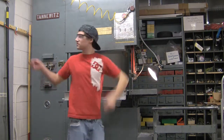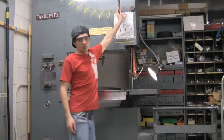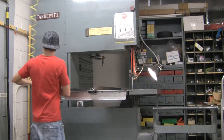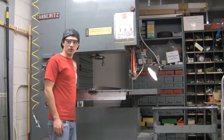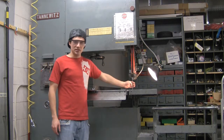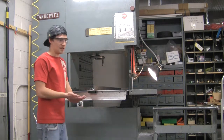There are three different blade types up on the wall. There's a dull blade, which you're going to want to use for wood, fiberglass, and any sort of abrasive material that's going to dull the blade. There is a fine blade, which you're going to want to use at a lower speed for steel and stainless steel. And then there's the coarse blade, which is on here right now — you're going to want to use that for aluminum and softer metals at a higher speed.